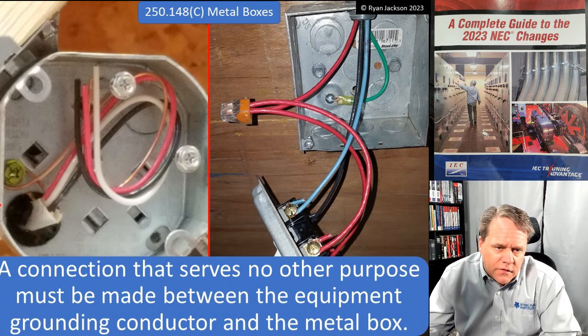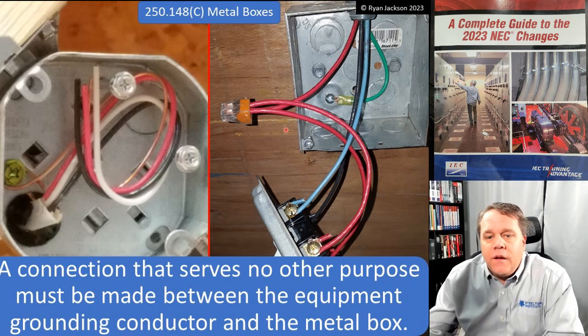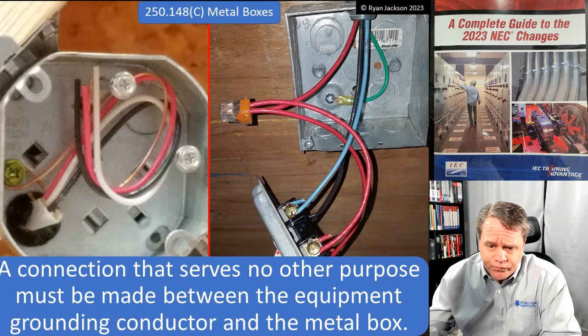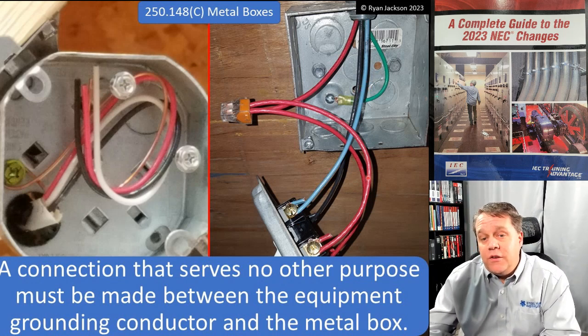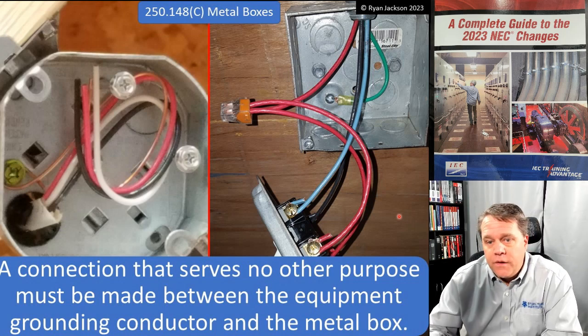That is going the wrong way, right? That screw probably ought to be going the other way, so when you twist it, it tightens the wire. Over here, good to go, right? This is a switch, as you can see. Do you have to run the equipment grounding conductor actually to the switch yoke? Well, if it's a plastic box, you sure do. But if it's a metal box, take a look at 404.9(B). You might be surprised at what you don't have to do to bond a switch.